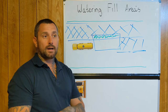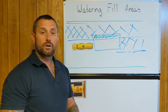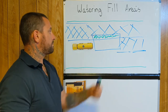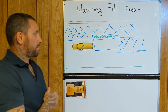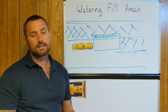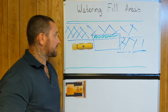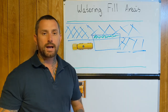That's what I'm trying to share with you, because this is a life lesson I've had to learn along the way of operating water carts — things I've done wrong that have had an impact. If you get too many sections over-watered like this, hypothetically you can get areas that start heaving. The more you work it, the more it brings the moisture up and it becomes mud, and that's not ideal when you're trying to get a nice hard compaction surface.